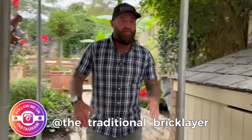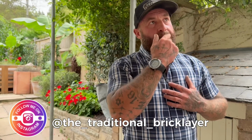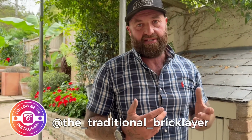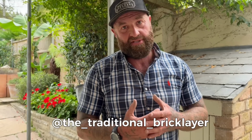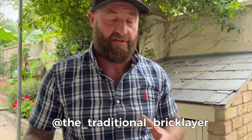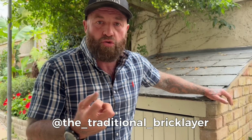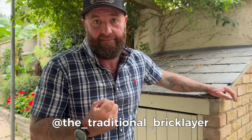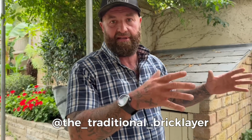You know, so this area is going to be represented like a courtyard. Now, we were talking to the client, the advantage of this is the London stock, the stock brick, was cooked at a different temperature. They were a bit soft compared to what brick is produced now, because it's cooked at higher temperatures. Now, the London stock absorbs the energy from the day, the heat. So when you come out here, this will be a self-contained heated area, lovely.